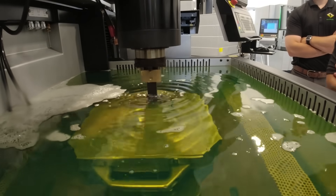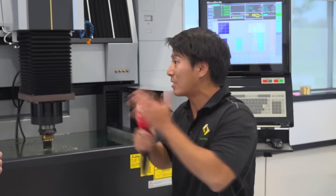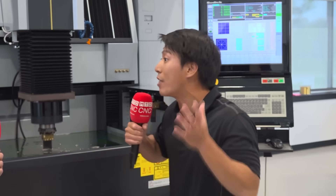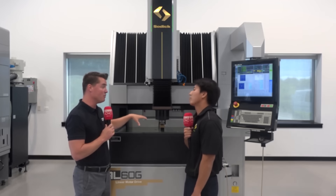You can add flushing — let me just start there — but because our speed is so fast, we don't need to. The benefits are low electrode wear: we get out of and away from that workpiece so quickly that you get less electrode wear. You're going to get better surface finish because all that debris is out due to that vacuum effect. And what does that mean? Better surface finish, better speed. So it is time, money, and quality overall that improves from being able to move this fast.